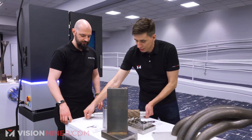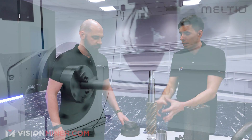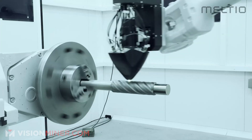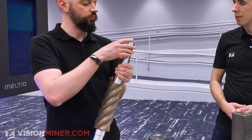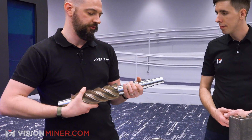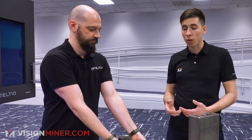This is an application where you've got an existing cylinder and need to add a custom feature. We started from an existing shaft and deposited the compressor screw onto it, which can then be finished and it's a ready part. This is one of the best uses of this technology — to repair or add features to an existing component. It wouldn't make sense to print a whole shaft; you start with an already-machined shaft and add material where you need it. With dual material you can add tool steel on bearing journals to increase their longevity, and you can even repair a hundred-year-old part so it lasts another hundred years.